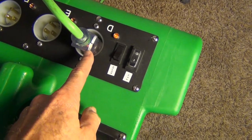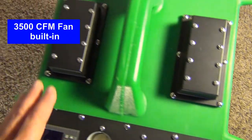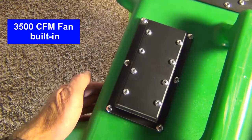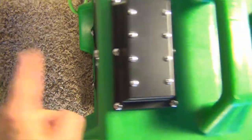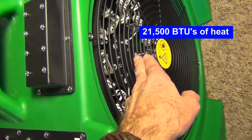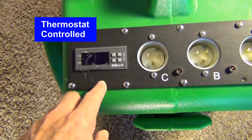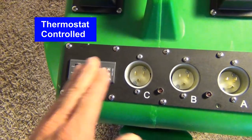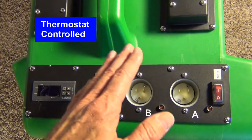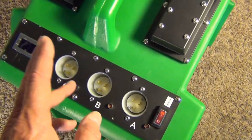We give you and recommend lighted-end power cords. These are 12-gauge, so each one is controlled separately. This unit has a 3,500 CFM fan inside the back end combined with 21,500 BTUs of heating power, and it's thermostatically controlled so you can set your temperature at a maximum. When it dips below that number by a couple degrees, it kicks the power back on, brings it back up, and keeps it at that temperature the whole time. This is the new ePro eradication heater.